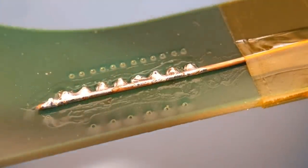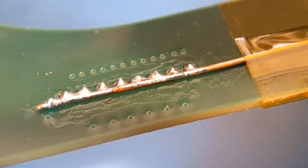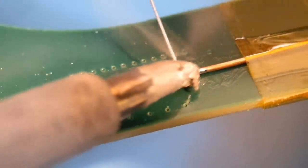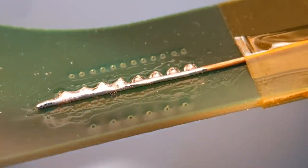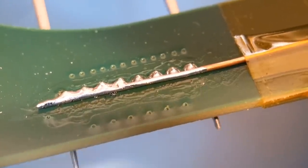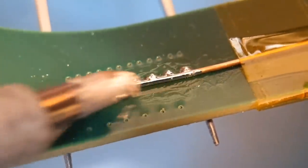Sometimes these pins are quite tight in the hole, but as long as all the solder's melted and you gently tweak it out you should be okay. I'm going to add some external flux around the area - flux is really useful for this, it enables the solder to melt quicker and flow better. So that's the flux all around the area. All I've got to do now is attach all those joints to that copper wire - go down the row one at a time. It'll all join to that copper wire, then just keep running the iron along the wire and it should drop out.